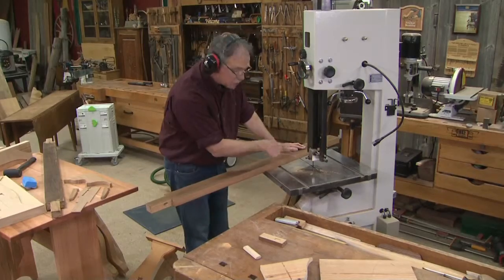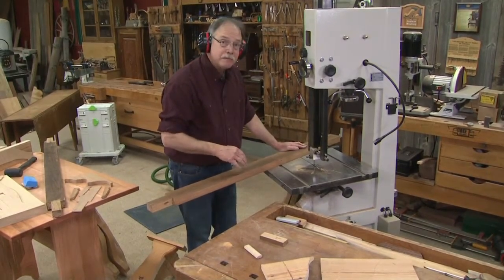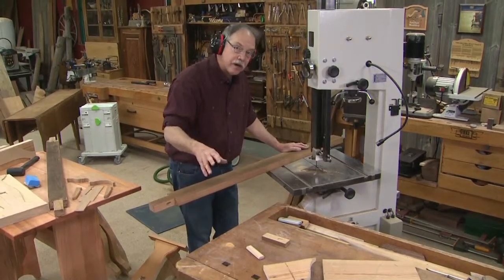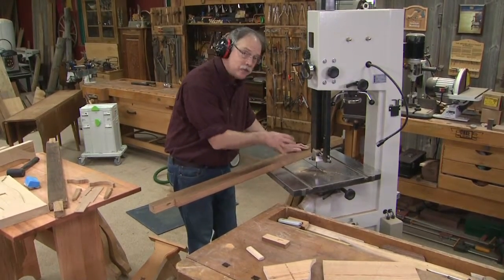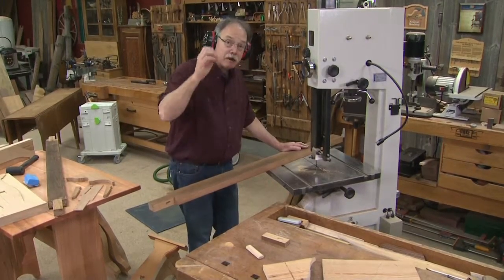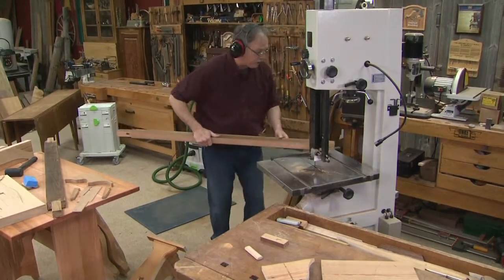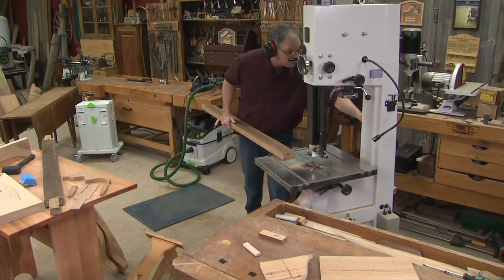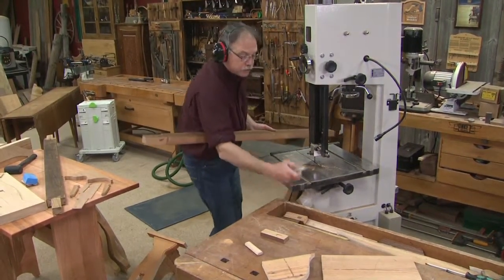You can see that's all the way through. The reason you make this cut first is it has to have the support of this flat edge for the fence of the domino machine to keep that square. I'll cut out the other end and then we'll mill out the post using the pattern. Be careful — that blade was still drifting, it just now stopped. So many accidents happen after the machine is turned off and people don't pay attention. That falls in the category of: be smart, be alert, work safely, and follow the instructions in the manuals that come with your tools.